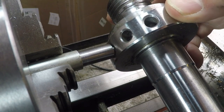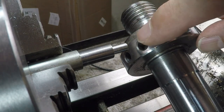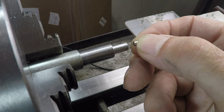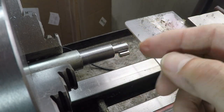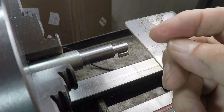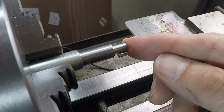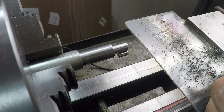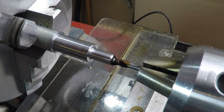It's not quite bottoming out. So if I can put a magnet in the end here, that will hit the bottom of this hole and hold it in hopefully. I found a slightly larger magnet in my collection — it's exactly one-eighth of an inch — so I can just drill an eighth-inch hole in here, set it in there, and leave it a little bit proud so that it'll hit the bottom of the hole inside. Starting with a centering drill here, shoot a little lube in there, and here we go.